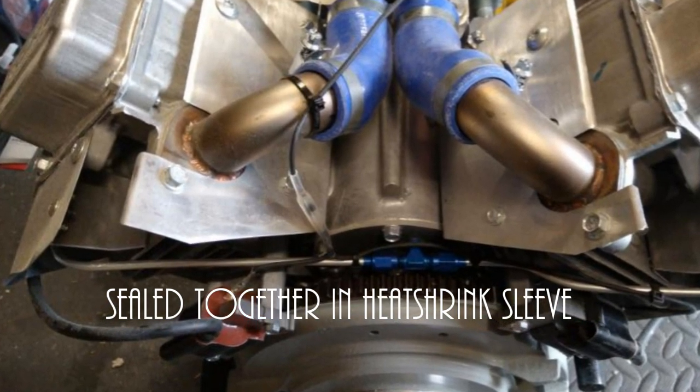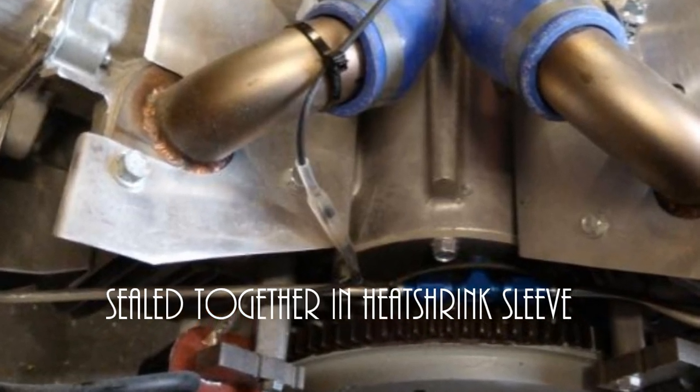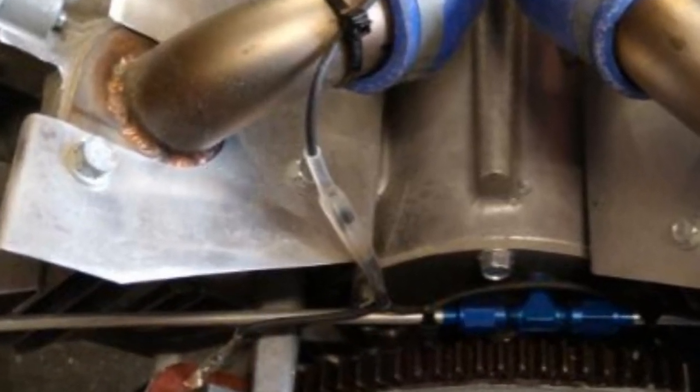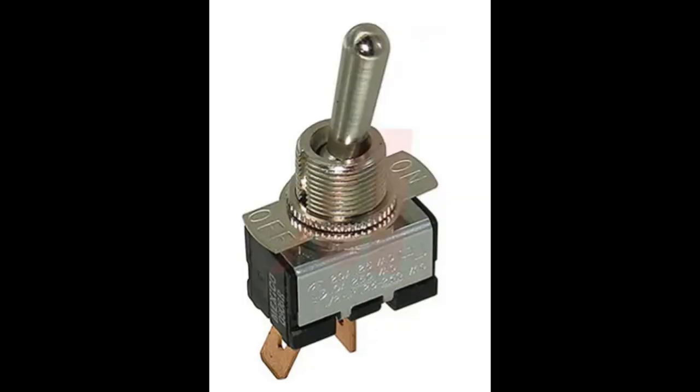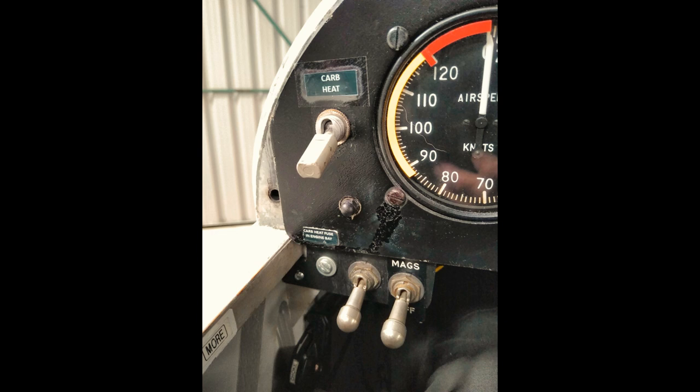This engine operates two magnetos. These are grounded through a single P-lead, which allows the use of a single mag switch, whereas most aircraft have two. So why? This saves the huge cost and enormous weight of that second switch. I'm not going to try to explain any more than that. I just got rid of the diodes and put in another mag switch. End of the problem in that area, at least, but I had to do some rearranging of the switch positions. And of course, I still had the fuel problem.